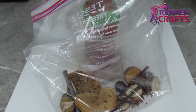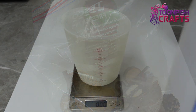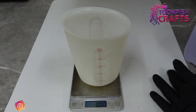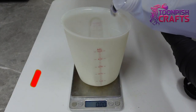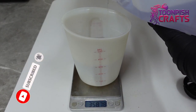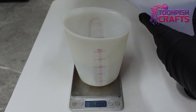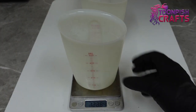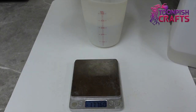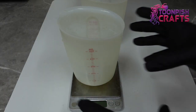These are the pieces that I'll be putting into the resin. And I'm going to be using Vuba Vista Ocean for this. Now Vuba is a 48 hour cure resin, the ocean version. It's deep pour resin so I know that I can do seven centimeters roughly on depth. Now I do have the wood in there as well and the pieces so that all takes up the volume, and hopefully I'm measuring out the right amount of resin.